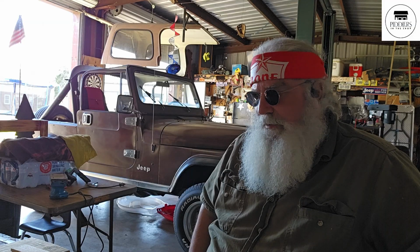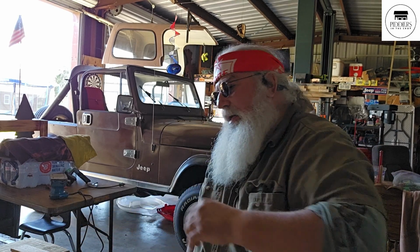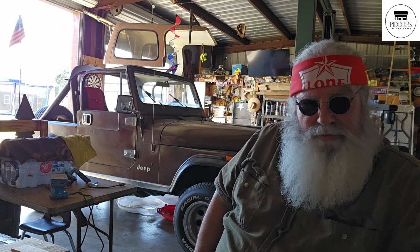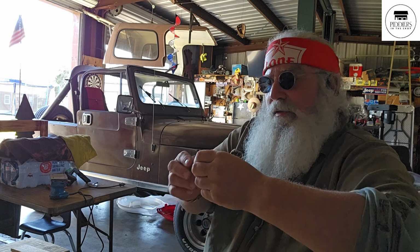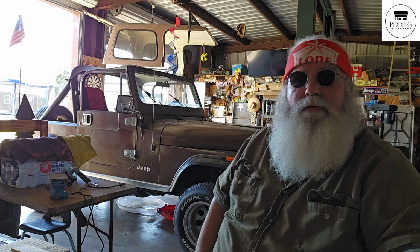Now, what I'm going to do first, I'm going to take the 16 gauge, and it's got 1 1/4 nails in it, and I'm going to shoot a couple just to hold the board in place, and then I'm going to come back with a screw, and that should pull it on real tight where there's no way it's going to fall off. I'm going to use these little screws right here. They're not very long, but they'll go through here, and they'll go on that board far enough, they should hold it on there.